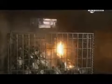To make forging easier, they pre-lubricate the slugs before heating them. That's why the slug flames up when struck by the press. It only takes 2 seconds for the press to do its job. But the forgings are so hot, they need at least an hour to cool before the next step.